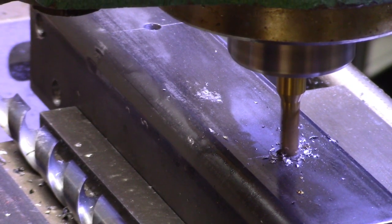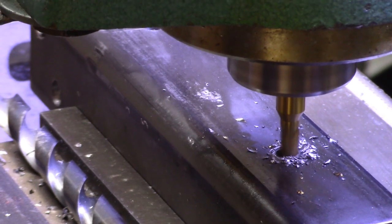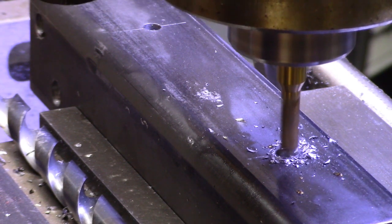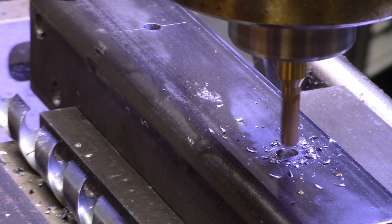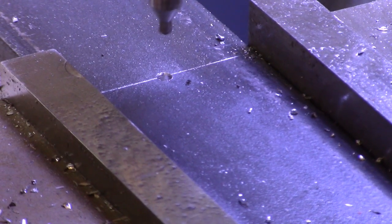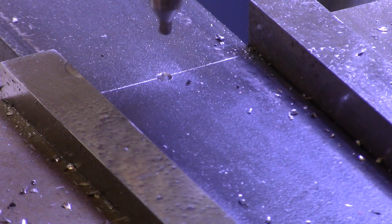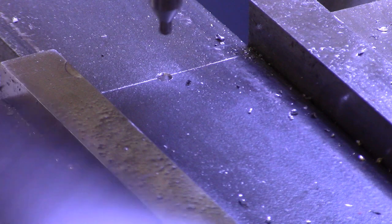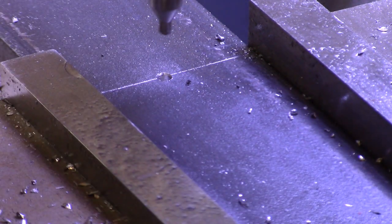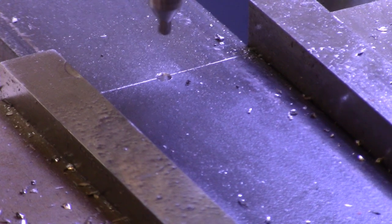Already got the 1/4 inch hole, so now to move over the other side a little bit. Do the same thing, and then I'll run it back and forth to make the slot smooth. I took my tri-square and my Randy Richards scribe, and I marked off the hole positions to exactly match this piece here, as you can see. And so now I'm going to make them 1/4 20.